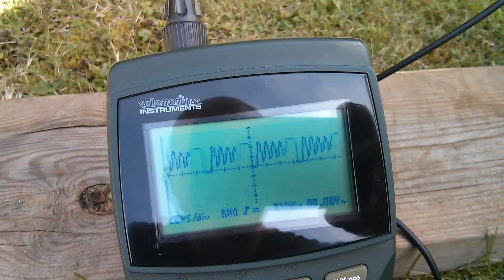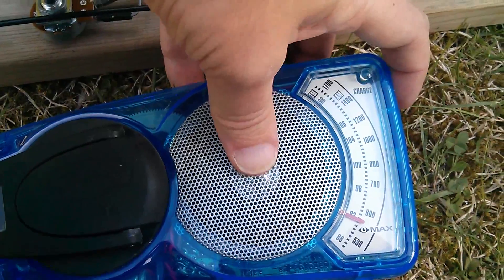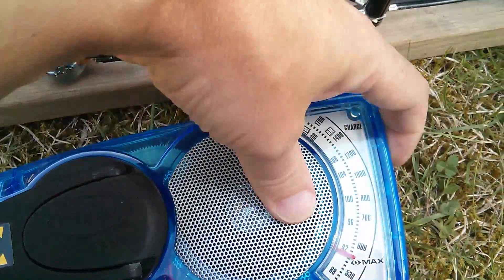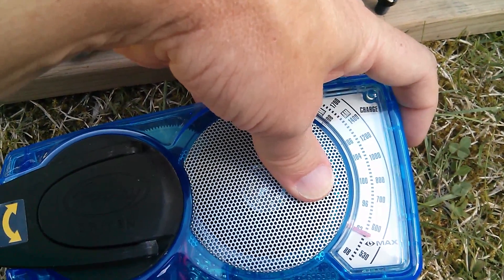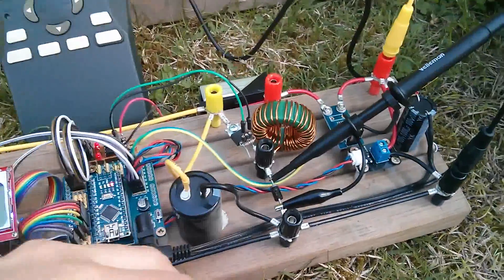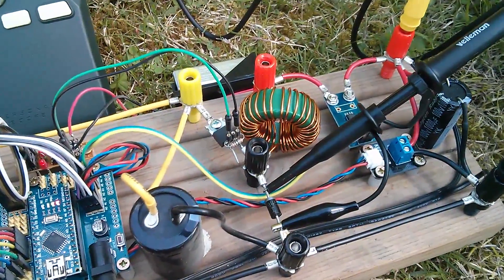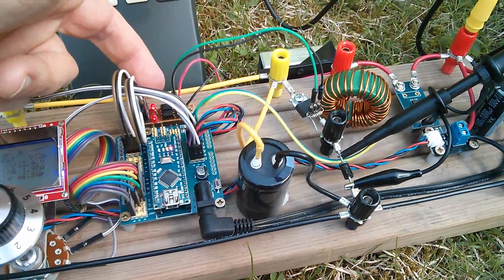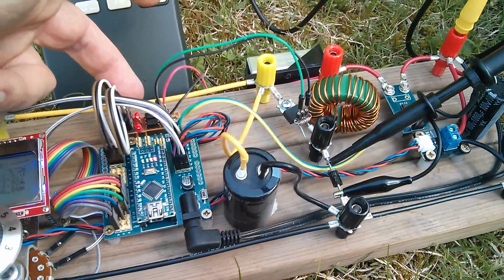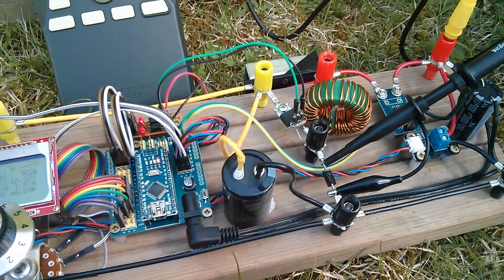That's off the AM waveband, so there's no pure tone coming through onto the radio. But if you re-tweak this for a square wave, a square wave contains all harmonics up to quite high frequencies, so it's now in the waveband of the radio — well, that's what I'm assuming with my limited knowledge of RF. Apologies if this is a noisy video — I'm getting quite a lot of 15kHz coming through onto the camera. I think it's time to raise the frequency, even though these opto isolators don't seem to want to go much higher. Maybe 17 or 18kHz — more annoying for young people, but us oldies won't hear that.